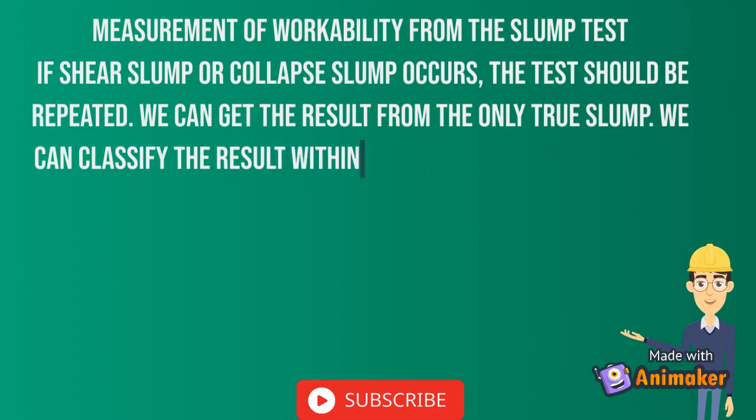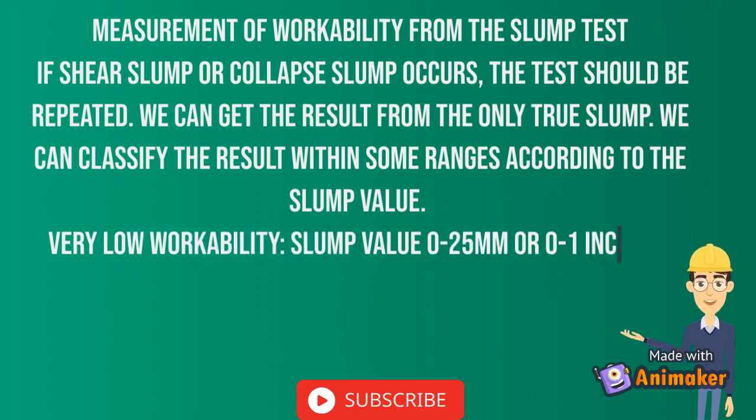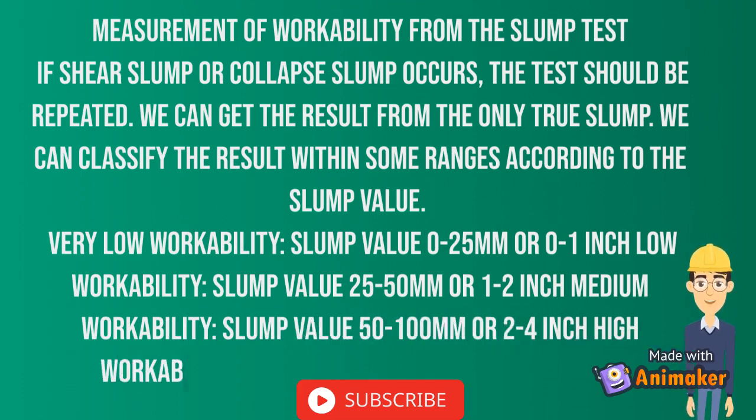Very low workability, slump value 0 to 25 mm or 0 to 1 inch. Low workability, slump value 25 to 50 mm or 1 to 2 inch. Medium workability, slump value 50 to 100 mm or 2 to 4 inch. High workability, slump value 100 to 175 mm or 4 to 7 inch.